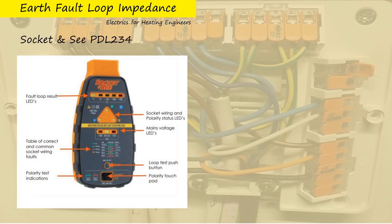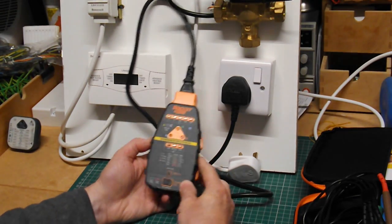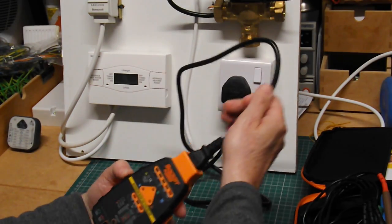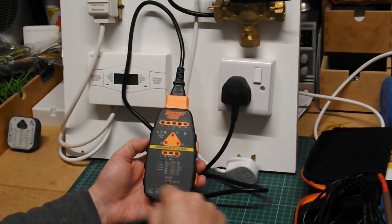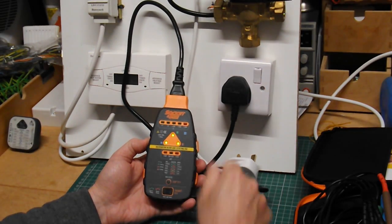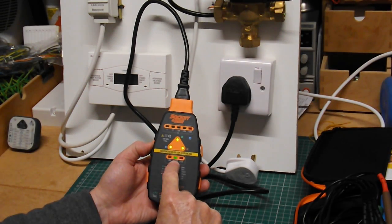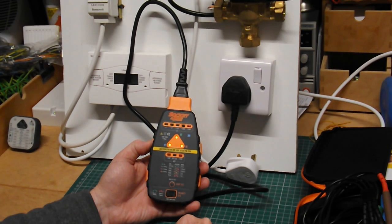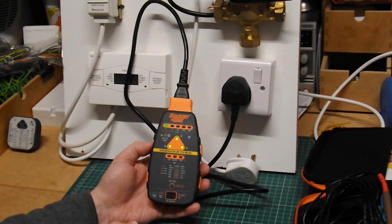As mentioned, this is such an instrument — let's have a look at it in practice. Here's the device: we can plug it in if the boiler is plugged into a 3-pin socket. We turn the power on and do a normal socket test. We know we've got our terminals connected and a safe working supply. We then press the loop button and get a readout at the very top: less than one ohm. That means our earth fault loop impedance is satisfactory.